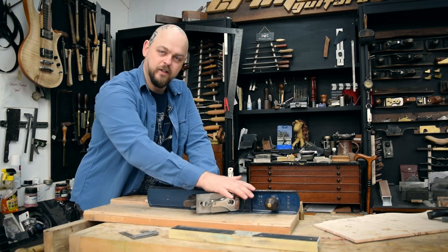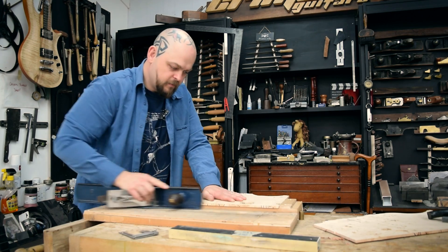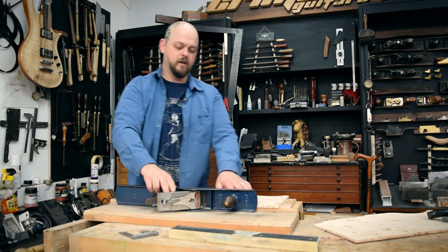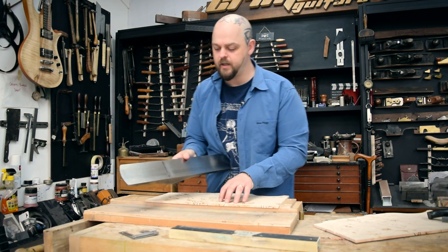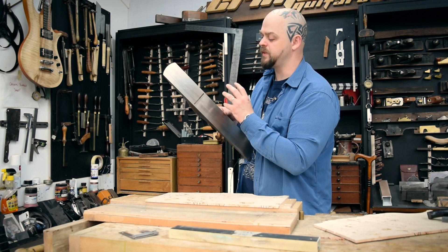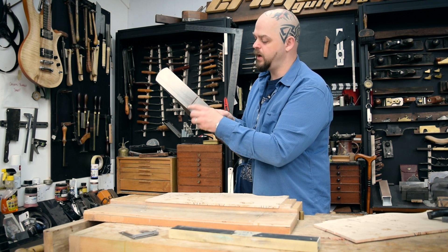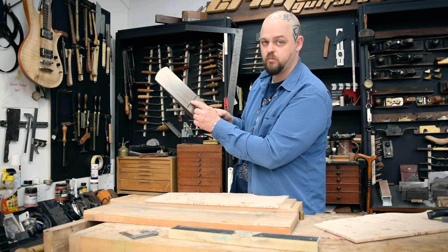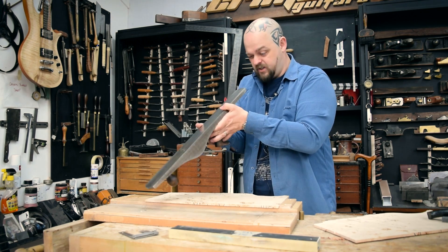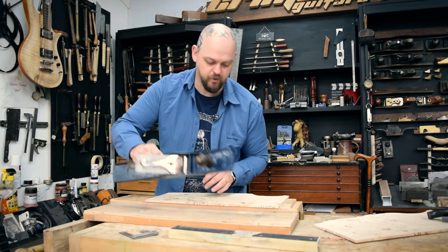On this plane, I'm holding it here — I'm not holding the handle because I'd obviously scuff my knuckles off. That's not taking very much material. It is important with a shooting plane that your blade is sharpened square and flat. With other planes, scrub planes are the extreme example — you will sharpen your blade with a curve in it so that it only cuts at a certain point. This you want cutting across and square. So double-check it — sight down the plane, or just use your fingers very gently because you don't want to delaminate your fingers. Check that it's poking out square.